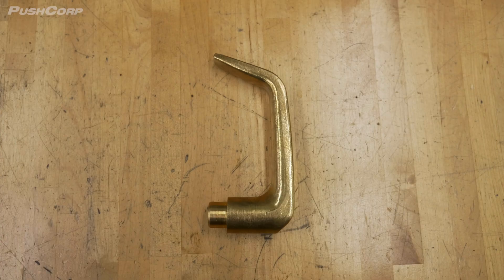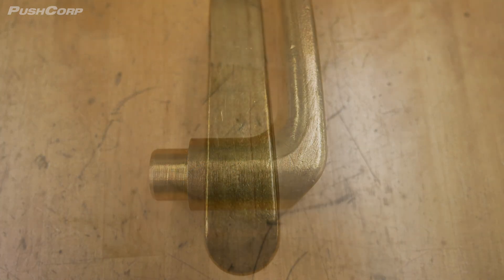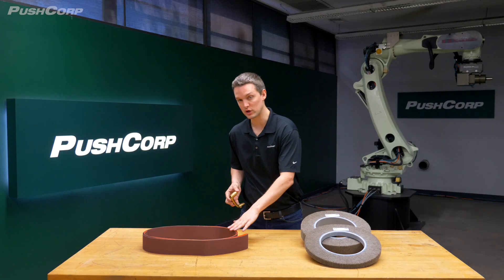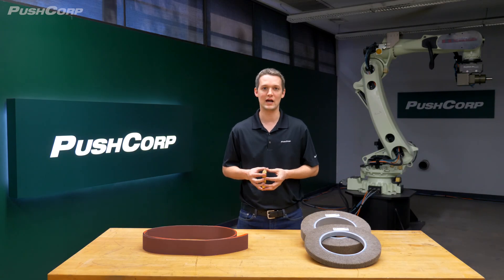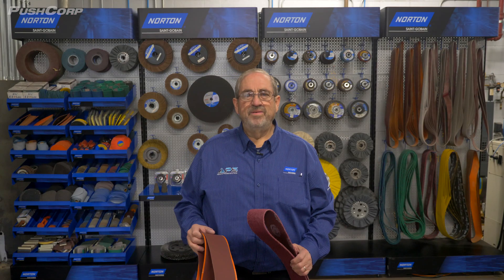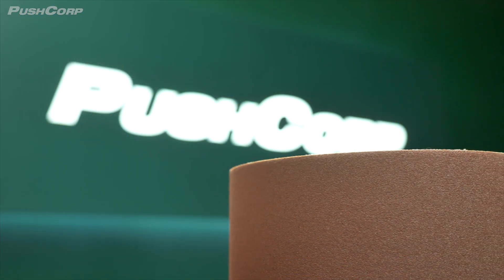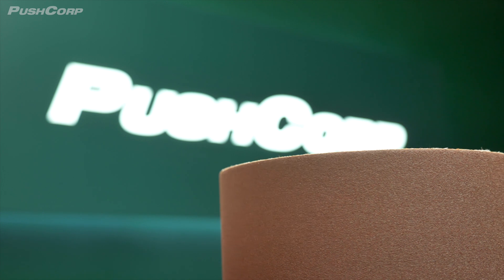Our first step was to remove the deep imperfections and marks from the casting process. We initially tested a flap wheel, but it wasn't aggressive enough for these parts. So we ran a Norton R945 120 grit belt on a 30 durometer contact wheel. Let's take it over to Mike to explain why this is the right belt for this step. The Norton R945 120 grit J-weight ceramic grain is a great fit for this part that has radiused areas as well as flat areas to be processed.